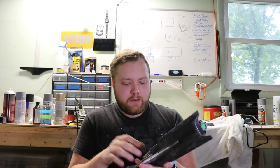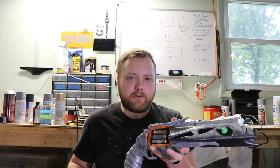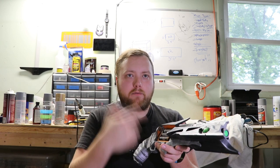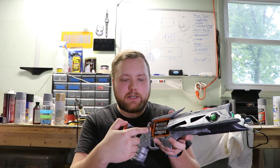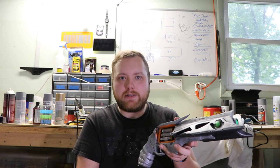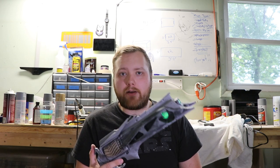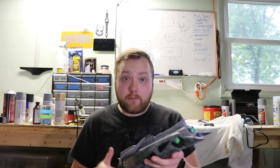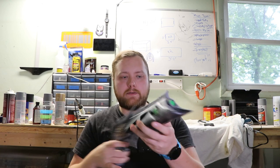Things I learned, things I don't like. One: the hole I made inside the model for the battery box ended up being just a smidge too small — like two or three millimeters. I could have reprinted the part but I was on a very tight time constraint, so I just Dremeled it out. Not ideal. My mindset with 3D printing is you shouldn't have to take a Dremel to it — usually I'd just redesign and reprint since materials are inexpensive. It doesn't look too bad though. Something else: the LED light is not that bright. Even though I bought a high-brightness 4-volt LED, if I were to do it differently I would have mounted three separate LEDs across all three of the little green orbs. That's all I have to complain about really.